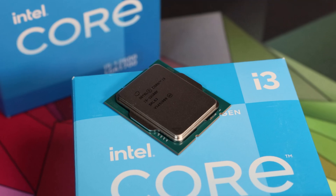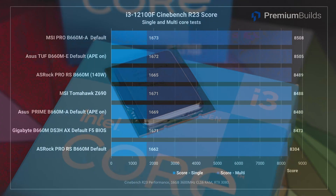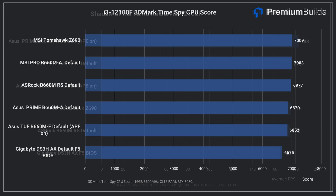So what can we conclude about the ASRock Pro RS? I actually delayed this review and my conclusions for a couple of weeks for two reasons. First I wanted to give ASRock every opportunity to help me fix this problem, and secondly I wanted to see how other boards behaved, so I delayed it to test other budget B660 motherboards and look at their response to different CPUs and how they applied power limits. We further tested with the i3-12100F — it performed adequately with that CPU although it did need some power limit tweaking for multi-core workloads. Another week of working with ASRock trying every setting and following their advice yielded no results.